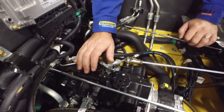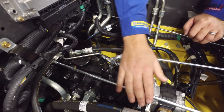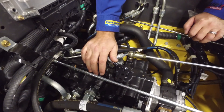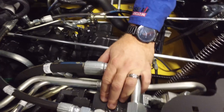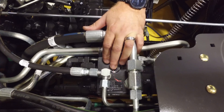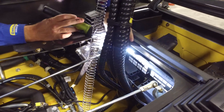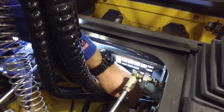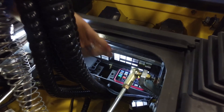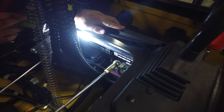This is a mechanical machine, so these are your drive pumps — these are your linkage to your handles. As you move your handles forward and backward, this linkage moves, making your machine go forward and backwards. Your main control valve is down here; this is what makes your boom and bucket go up and down. They've also put all of the electrical components down here underneath the cab in these sealed areas. Squeeze both ends to open those up. They are labeled showing what each fuse controls and what size fuse should be in each hole.